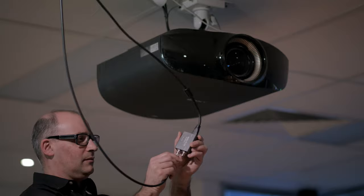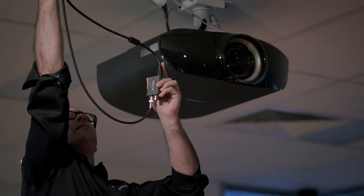A really nice solution is to use an HDMI to SDI converter and an SDI cable up to a video projector with a microconverter SDI to HDMI. This is a great way to extend the connection to a video projector because you're not limited to HDMI cable lengths, and you can add a router or other devices too.